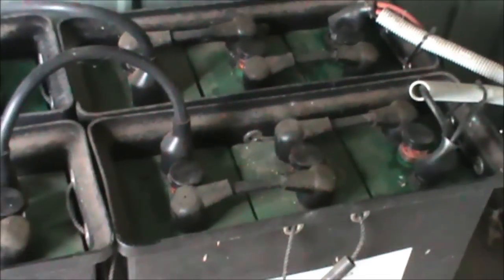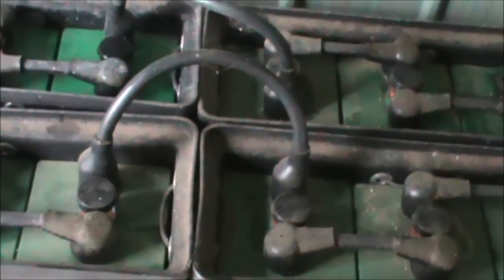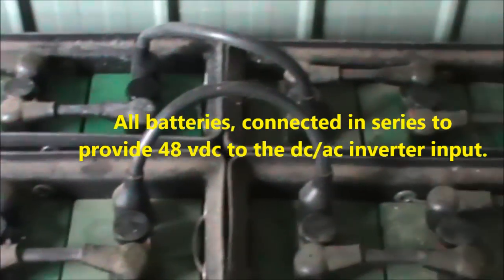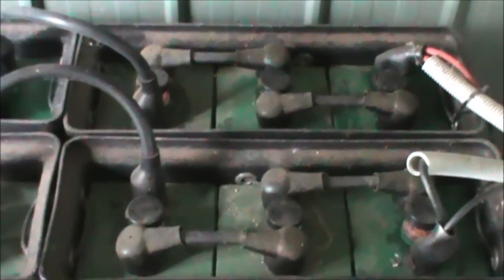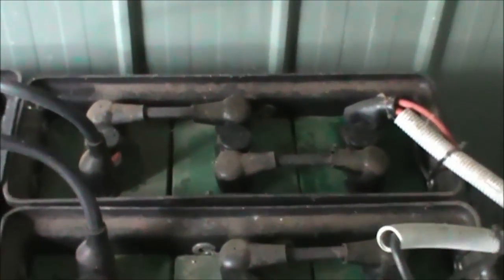Follow these cable feeds down — remember this is still 48 volt DC — then we come down to the battery banks. These battery banks, considering this system is 6 years old, they're actually 2 volt lead acid deep cycle cells. Each cell is arranged in series, so the whole battery system is wired up in series to give you a 48 volt DC input to your inverter.